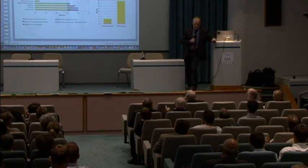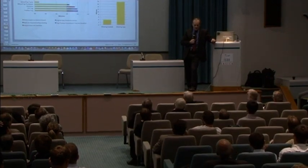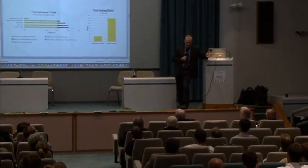Well, you'd have to start your engine at the same place. No. Why not? Well, there's 2 answers to that. The first is that WheelTug doesn't stop you from rolling forward. It allows you to drive forward anyway. So you get to 5 or 10 miles an hour, and you start your engines as you go. Right. So the second part is the time savings from not having your head down while you start the engine when the aircraft isn't rolling.